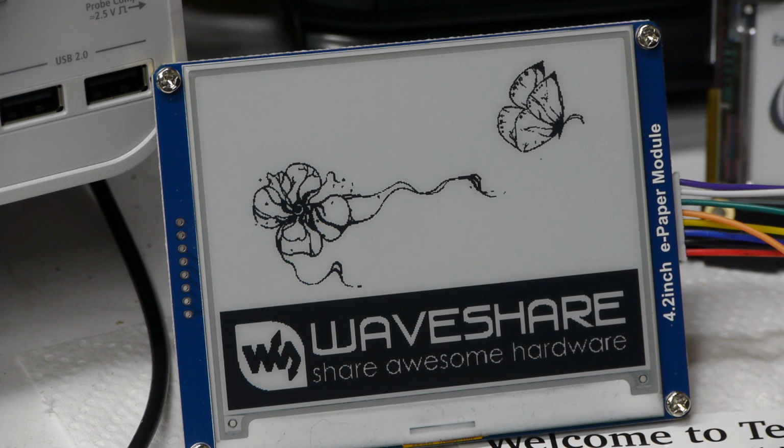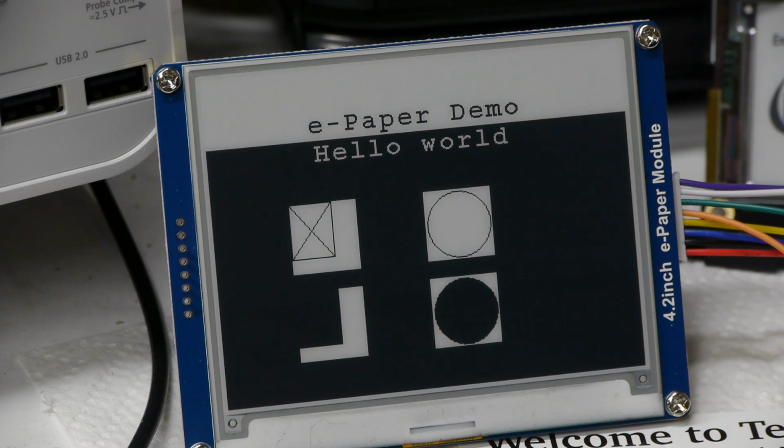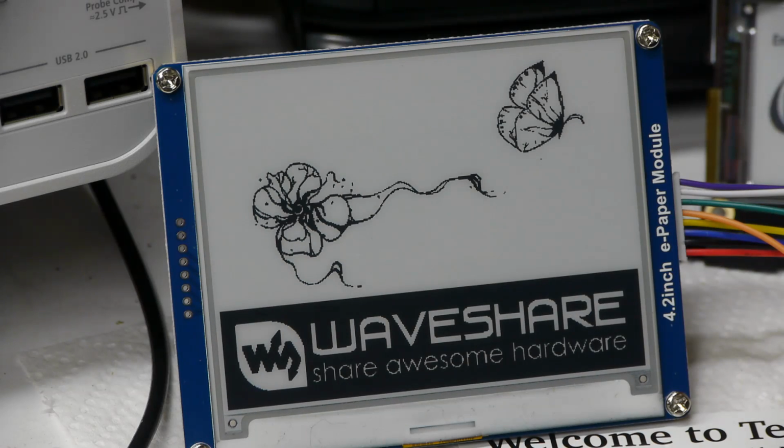Okay, I'm going to run the demo that comes direct from Waveshare. It's just 2 frames, and so it's compiling and downloading. And you'll see when the image transitions, first you see the inverse of it, then all white, then all black, then the image. This is the frame. And then it's going to switch back to the first frame, and as you can see, it's a pretty long process. So you can't change any part of the display without going through that entire multi-second refresh routine.